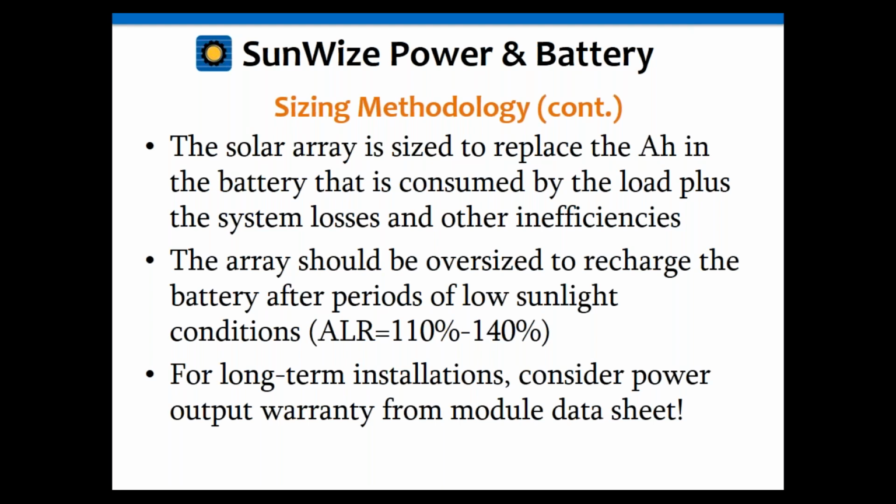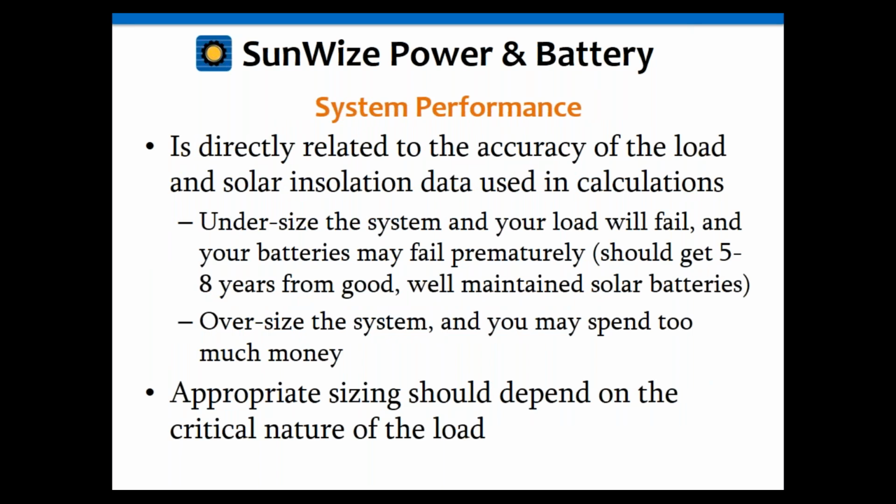Also, you may want to consider that, and I'll get into some more losses. We talk about the losses: solar module power output does degrade over time. This is one of these interesting things about solar modules: they actually degrade in sunlight. The irony of that. So as soon as you put it out in sunlight, the module starts to degrade. The degradation is very low. It's between 0.5% and 1% per year, which is negligible if you're thinking 5 or 10 years down the road. But if you're thinking 20 years down the road, you're now looking at degradation of 10% to 20%, which might be enough for your system no longer to work. So that's something you might want to consider either in additional rate of load ratio or perhaps in your system losses. Actually, usually I build that into the system losses personally. I usually add that as well as dust and other derates there.